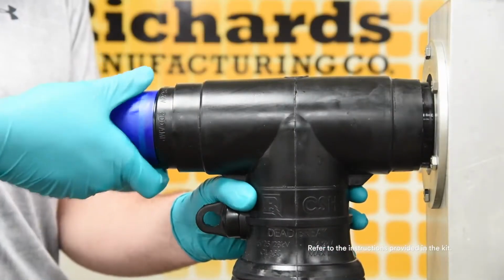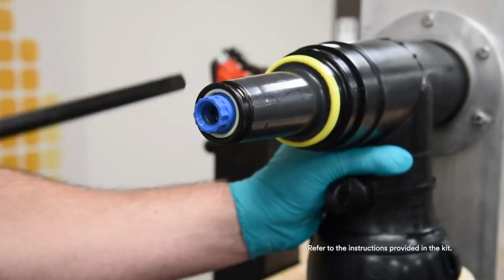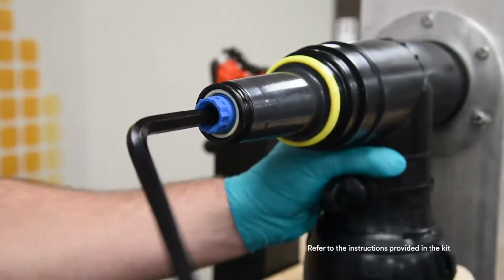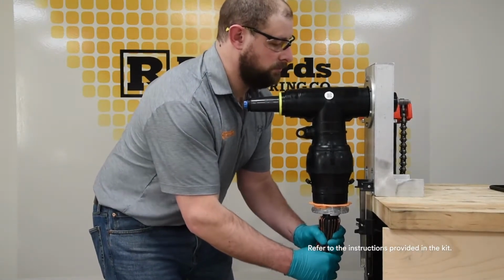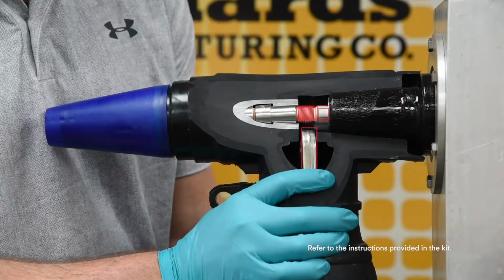Insert the supplied disposable hex tool or approved alternative tool into the CS8 load break interface and engage the hex broach of the fastener. Rotate the tool 2 to 3 turns to start thread engagement. As an additional check that the stud is through the hole in the lug, tug on the power cable. Only a small amount of movement should be possible. Any significant movement of the cable indicates the assembly is misaligned and the seating step should be repeated.